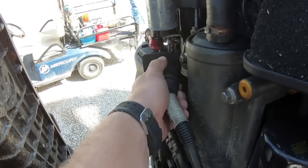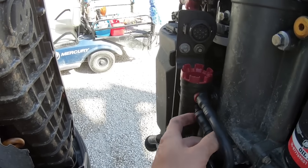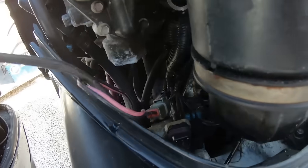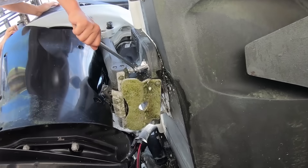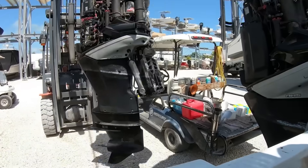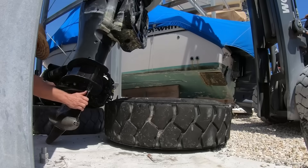That's like saying everyone should wear size 10 shoes because it's average. The physics here are fascinating. When your engine sits too low, you're essentially dragging a barn door through the water. That lower unit creates massive drag, and your prop is working in disturbed water that's already been churned up by your hull. Every inch you can raise that engine — within reason of course — reduces drag exponentially.